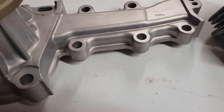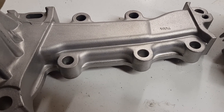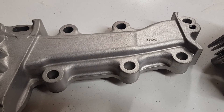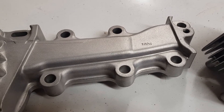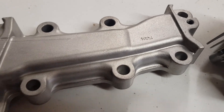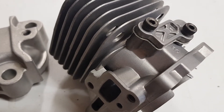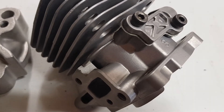The new mixture has kind of lost a bit of that nice gray dark luster that you can see in this part. It cuts a little more — I've got to order some more media — and it potentially has a deeper cut. Using them together, I'm assuming, will shorten the life of the glass beads. So what I'm thinking is I'll set up a second cabinet: the first cabinet with a mixture of two different medias that cuts a little faster to get everything cleaned up, and then in the other cabinet I'll have all the nice new glass beads with the right sizing and the right nozzle to get that really nice gray luster finish.